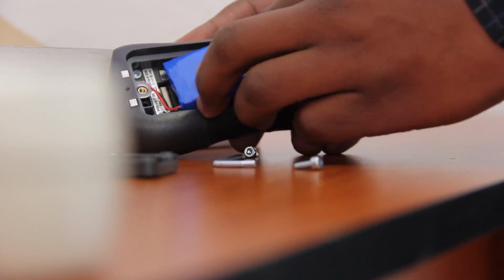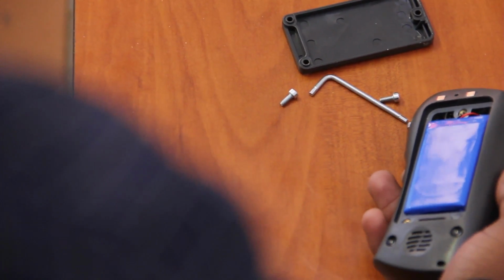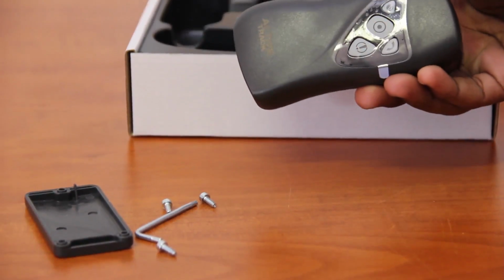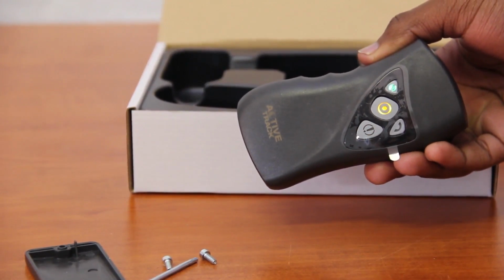Connect the battery to the white socket of the battery cable clip, making sure that the pins of the socket fit the female sockets of the battery cable connector. When connected, the device gives 2 short clicks to indicate that the unit is switched on, and the LED lights on the front should flash.